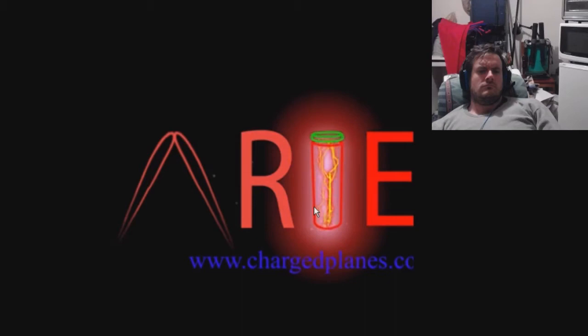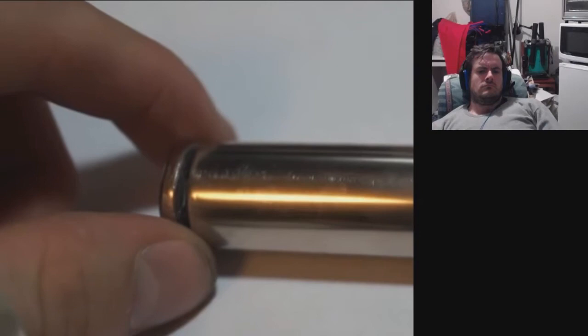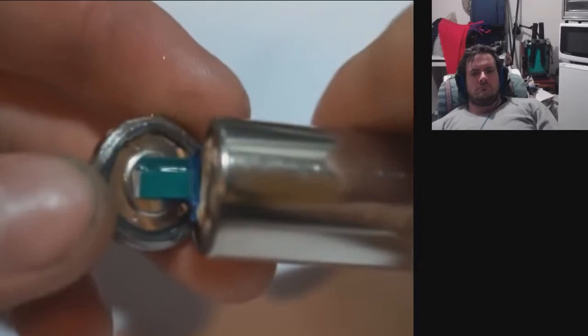Today I'll be dissecting a Tesla cell to find out what's inside. Before I do this, I want to emphasize that this cell has been fully discharged to 0 volts. As a result, the battery has no charge and it's completely safe to dissect. Now first, I had to find a way to get into the battery without damaging the lithium. Cutting into the positive terminal gap made the most sense since this was the thinnest part of the battery, and the anode and cathode did not extend above this gap. Now the first thing we can see is the lithium wrap and retainer.